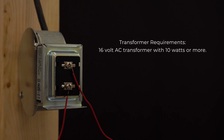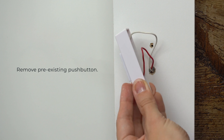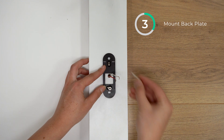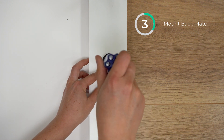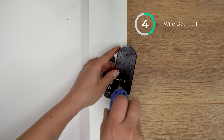From the electrical panel, turn off the power and consult a qualified electrician as needed before proceeding. Verify your transformer's power rating — this doorbell requires a low voltage electrical connection. Do not connect directly to a 120-volt AC transformer. If you are replacing a pre-existing doorbell button, remove it now. Feed the wiring through the mounting plate and secure the back plate to the wall using the included mounting screws. Connect the transformer wires directly to the two doorbell terminals and tighten in place.